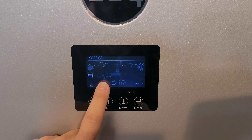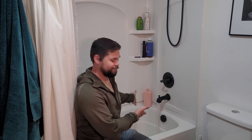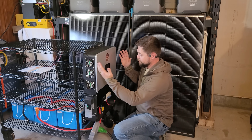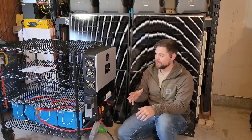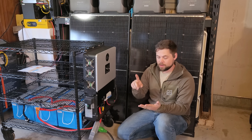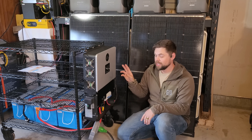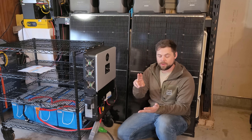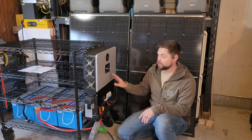You can see it's using about 1.5 kilowatts to run power to my whole house with everything already turned on. I can run my mini split air conditioners, take a shower and run the well pump, run my 3D printer, watch a movie — every outlet has power, every light switch works, and my fridge and freezers keep running just like normal. The biggest thing to keep in mind is you may need a larger inverter; in my house I mostly use propane for anything heat related — hot water, drying clothes, cooking — so my loads are pretty low at about 30 kilowatt hours a day.